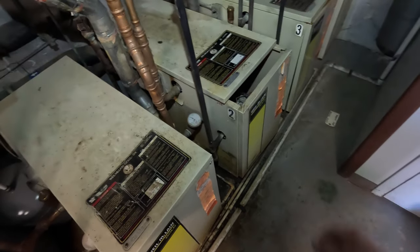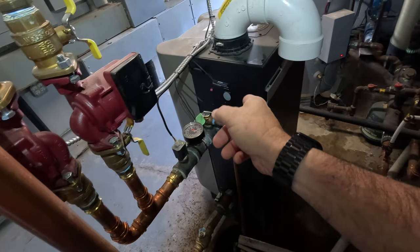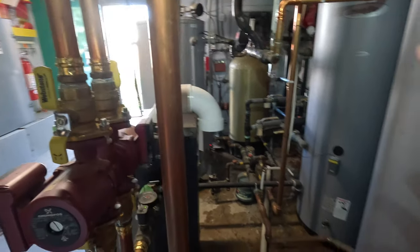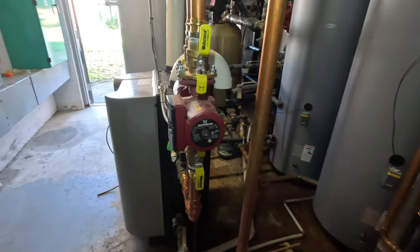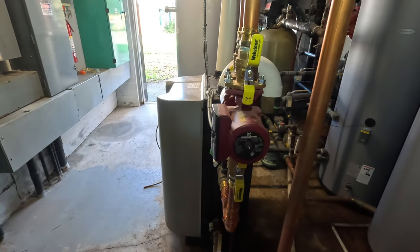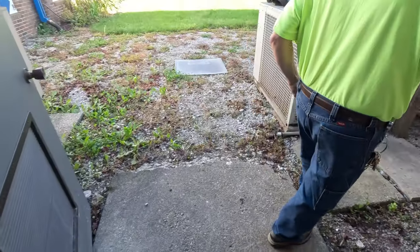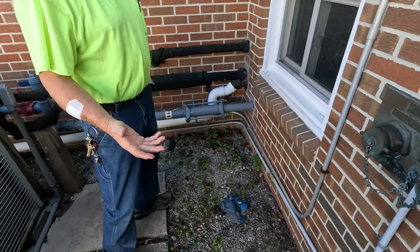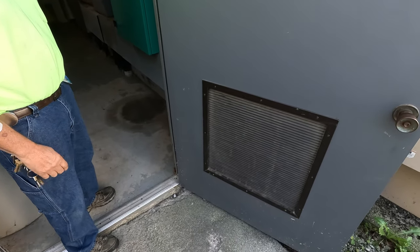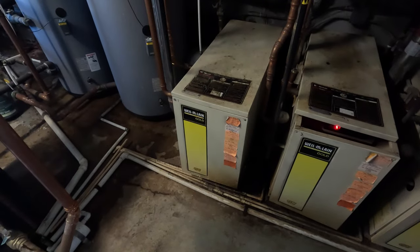I think we need to get you some prices on some new equipment because this stuff is - you're going to sink a ton of money into it. You might be able to get away with one larger one. With higher efficiency going on, right now you got all this combustion air being used in here. There's a big hole in the door over there for combustion air - if it doesn't pull from there, it's going to pull from the building. I don't think you can have cardboard covering that. She was wrong - the state supposedly inspected and didn't say anything, but I think there are issues.